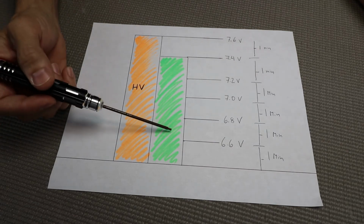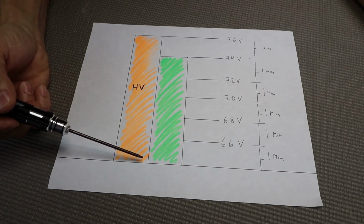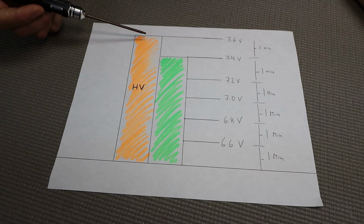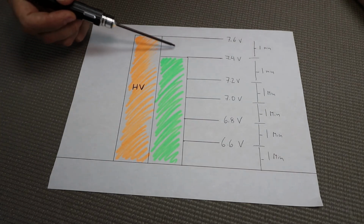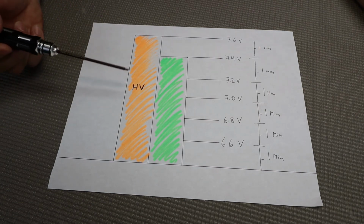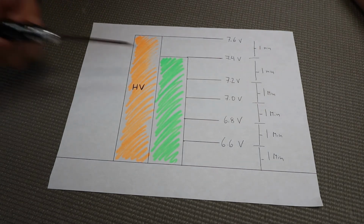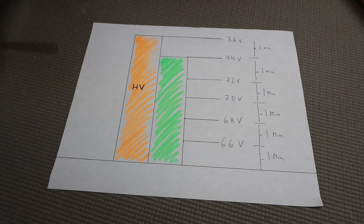and we've got further to fall. So both of these batteries are going to drop down to the same voltage. Your ESC will cut off at the same voltage, but since we're starting out higher, we just got further to fall. So hopefully that explains why there is a short period of time where you'll flat out make more power, and then the rest of the charge cycle, it's making more power at a different time in the charge cycle, and it's just going to last longer until they both hit that low voltage cutoff.